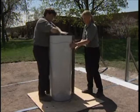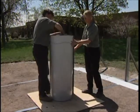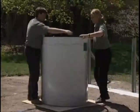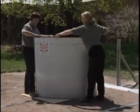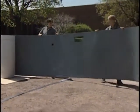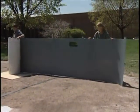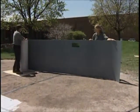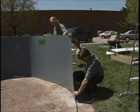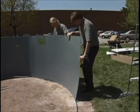Do not attempt to install the pool wall on a windy day, and if possible, get several neighbors or friends to help. Uncoil the wall until you reveal the skimmer cutouts. Ensure the skimmer is on one of the round ends directly across from the most prevalent wind direction. The end of the wall must be placed directly over one of the base plates in order to hide the wall seam behind an upright.